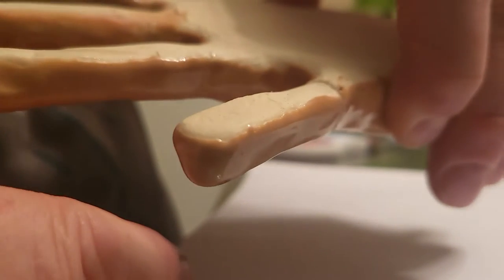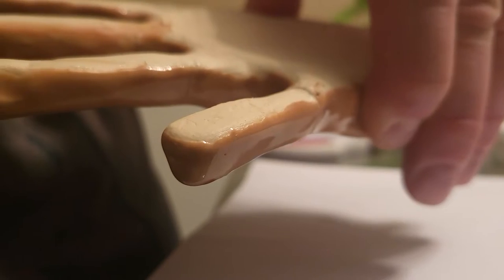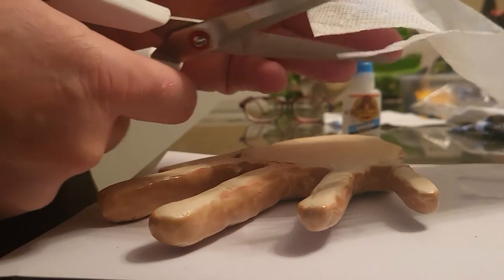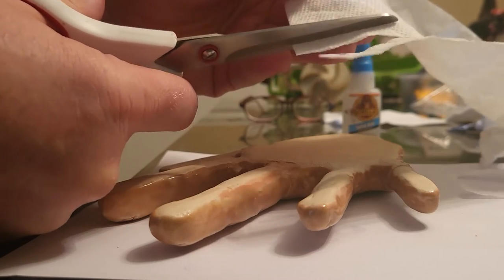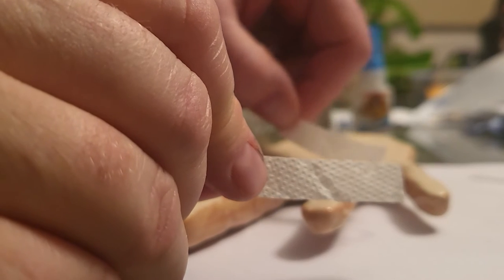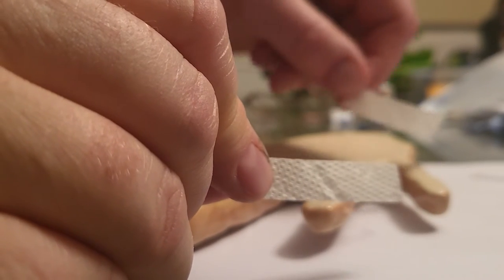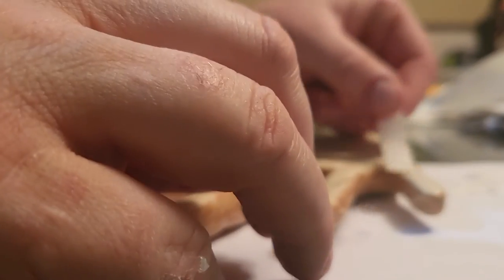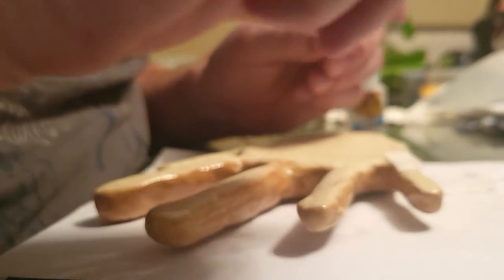I want to seal this little gap right here. The way to do that is take a paper towel or any type of mesh-like material. I like using anything that has polyester in it — fabric-wise, it works really well since it's more of a plastic material. I'm going to take this little piece of paper towel, stick that over the crack, and put a little bit of the more liquid super glue — not the gel type — and that will hold it really pretty well. It's kind of like a Band-Aid.